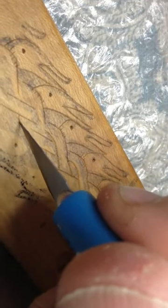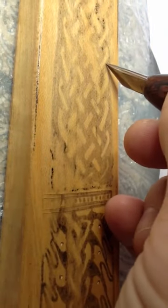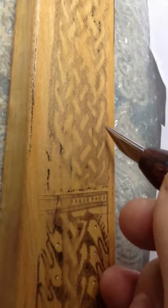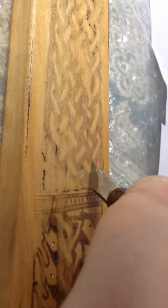The main thing with the technique is to keep the blade vertical so that you're creating a V-shaped groove in the wood. It's only a very shallow groove, but it mustn't be at an angle. It's not like chip carving where you're cutting wood at an angle — you're actually cutting straight down. And as you turn and do curves, you have to keep the knife and rotate the knife as you go.